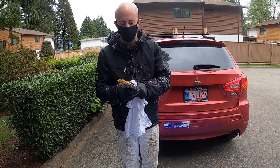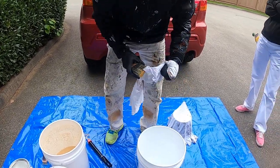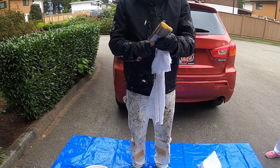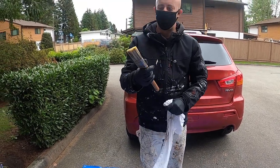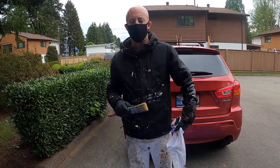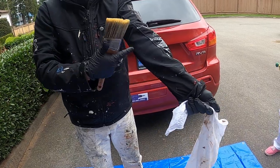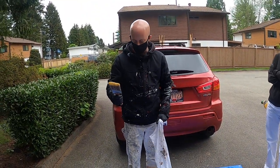If you've been using the brush all day, sometimes just take a rag, dip it a little bit in paint thinner, and use that to clean off the handle — making it nice and clean so you're not getting other products in there. That includes the wood handle; you can use paint thinner to clean that off too. A good test is to wipe it on your sleeve — if no paint comes off, you've cleaned out the brush pretty well.